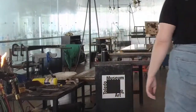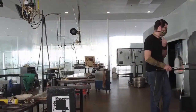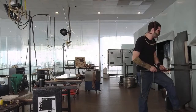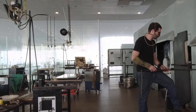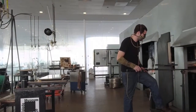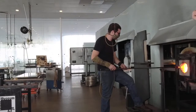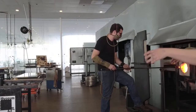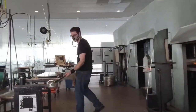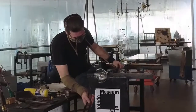Your cup jacks? Oh, yeah, I gotcha. Misha's gonna get a little bit smaller of a set of jacks. He's got a nice narrow hole, so we got jacks of all sizes for all hole shapes. So Misha's gonna spot heat that hole, and he's gonna use the jacks in a different orientation. He's gonna physically open it up like a mold. If we were making something sort of traditional like a cup, we could really use our jacks to rip it open and really set the wall sides. But in this case, Misha's just making a space so that George can get in there with his spoon and get all of that nice frit in there.